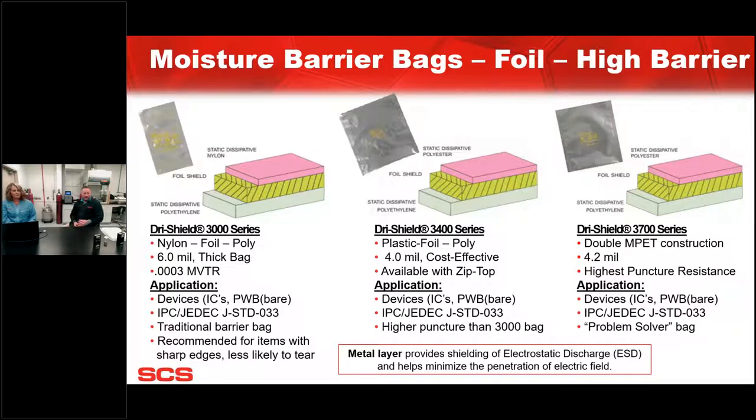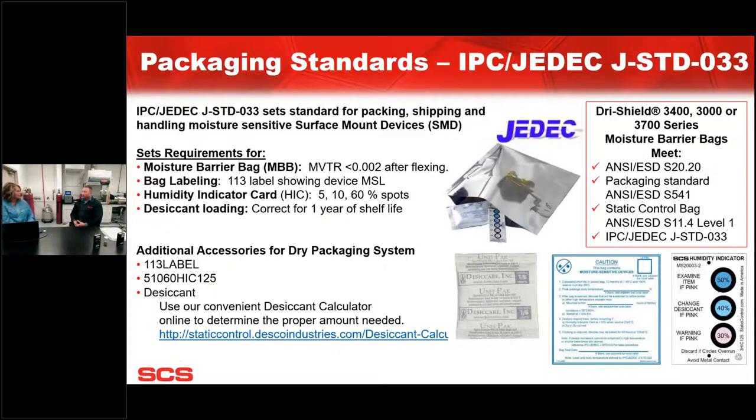It's about 20 times the amount of a static shielding bag. So if you go from a static shielding to an entry level low barrier, you're getting a lot of MVTR there. So it works for some people. And then our high reliability or less than 100 or 50 or high corrosion atmosphere. Right. If you're trying to protect all that, then obviously you want to go to the high barrier and use that JEDEC requirement.